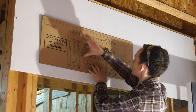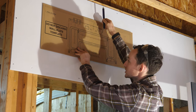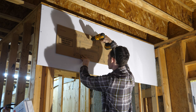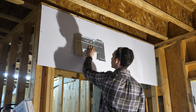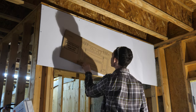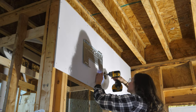Now let's get our brackets up. They provide a handy cardboard template that helps with initial marking — it's easier to visualize than the bracket alone because it shows you actually where the unit sits. We've got this one centered over the door. We need six inches of clearance to the ceiling, so this is the highest it can sit. The template is also great for marking the big hole for the line sets.